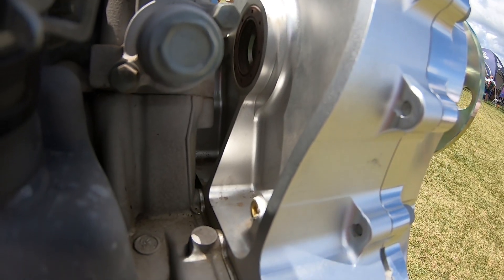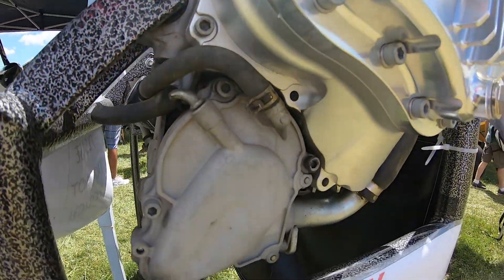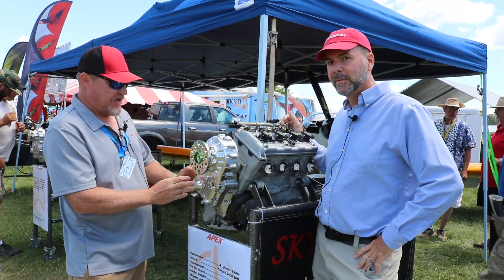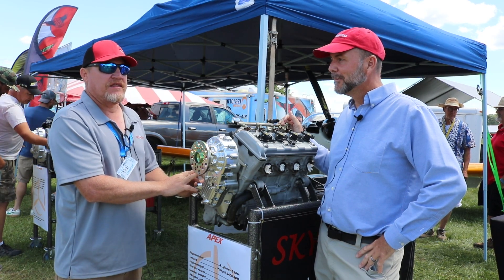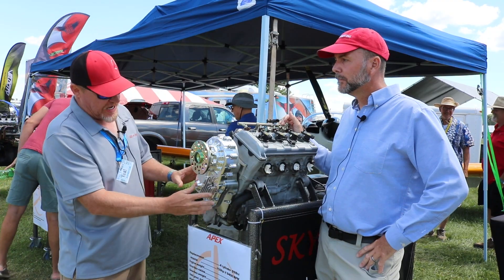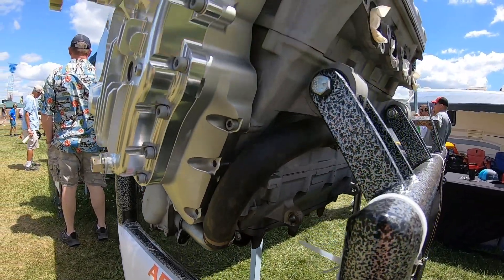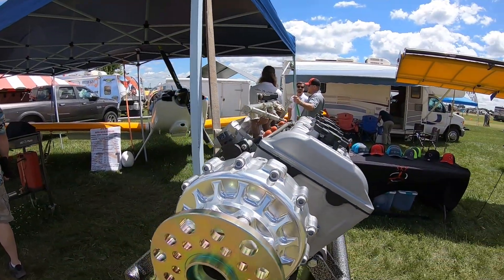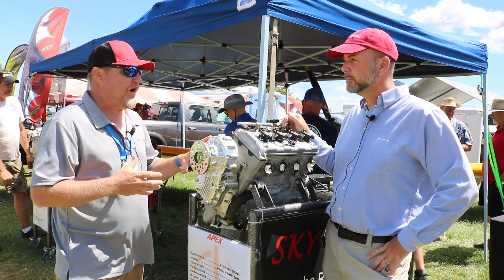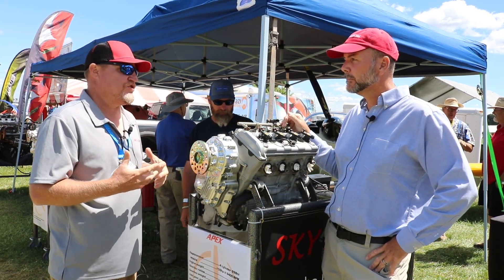This is the first one you designed. What are some important things you learned in your research about gears, meshing, fluid viscosities, and oil quantity to keep it cool? Our first learning: the first housing was basically a block of aluminum with three cutouts for the three gears. We found the oil heated up really quickly and we were getting foaming because the oil was always kept in suspension. So we added the reservoir with cooling fins and it's internally baffled. The key lesson: get the oil lubricating what you want, then get it off and let it settle — separating air and oil while dissipating heat. Also, we had trouble keeping the fluid in the box no matter what we did for a vent, until we created the internal baffling and the side reservoir.